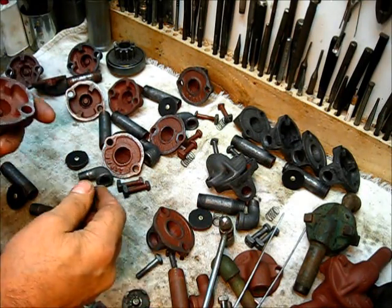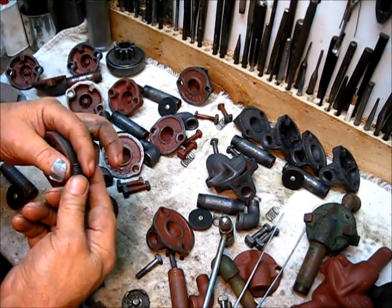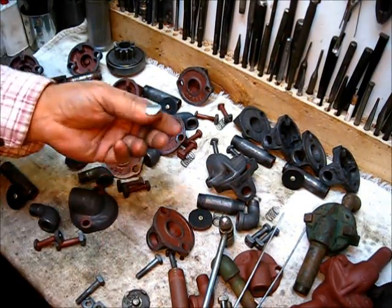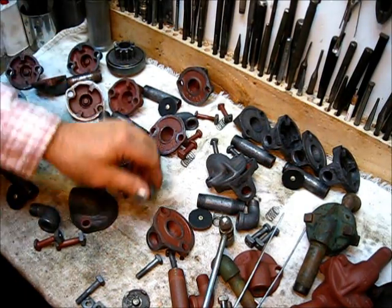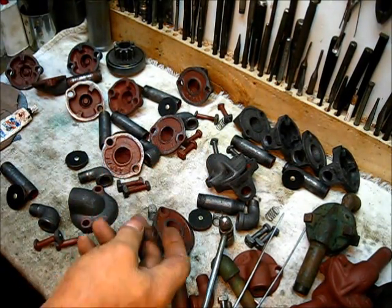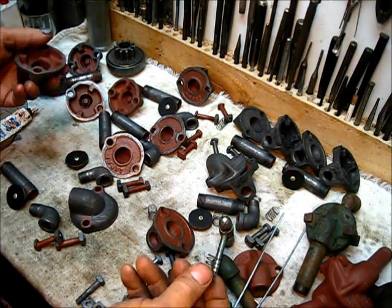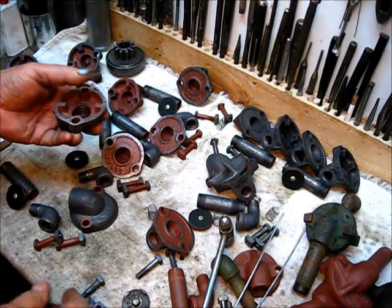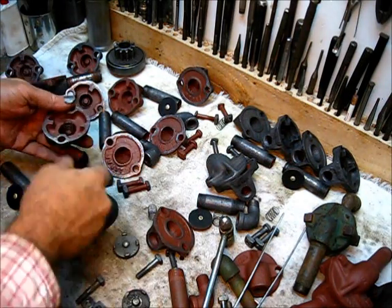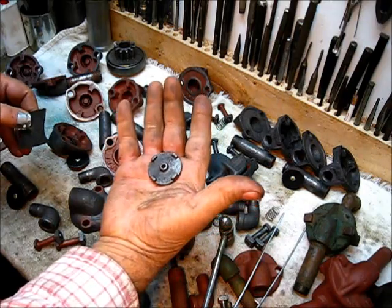The vacuum also aids in preventing oil leaks at the bearings. The most critical part of this whole thing is the tension on the spring — the size, the whole thing. Do not use a cadmium-plated spring in this engine. If you have to use a cadmium-plated spring, just leave this off. There is a reason not to use plated parts on these engines.